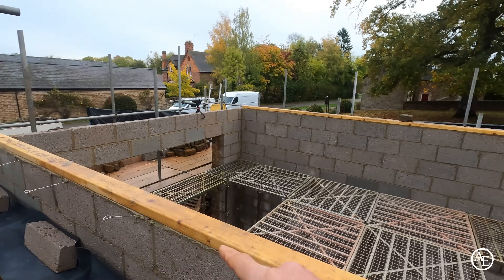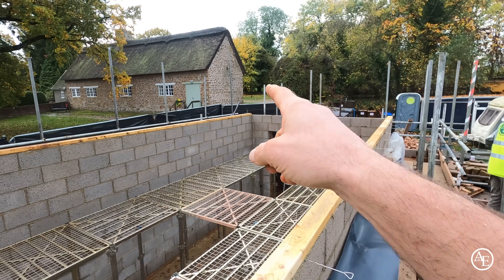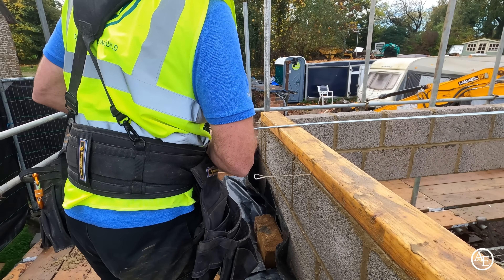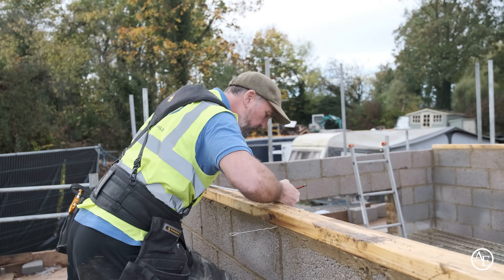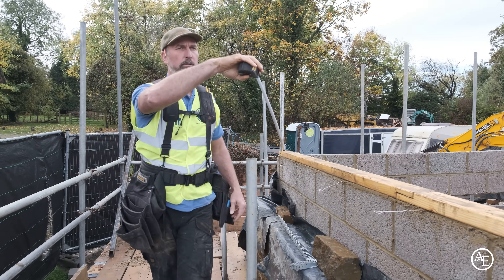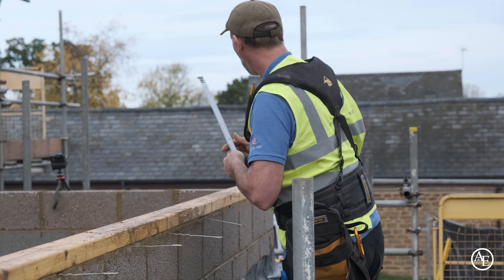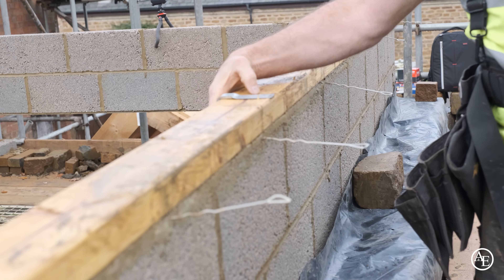Will has kindly bedded the plates on for us. Me and Matt have set up all the g-decking inside. What we're going to do now is mark out the trusses on either side - the measurement is 3775. We've been pinching a little bit, so we'll keep it at 3770 and cut all the trusses off for that. Then the next one at 600 centres.